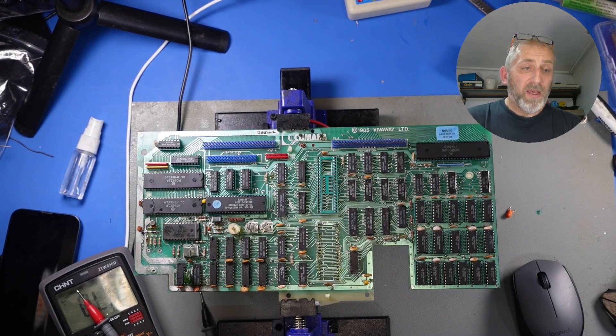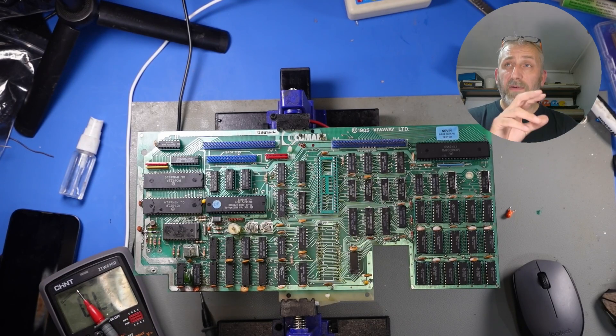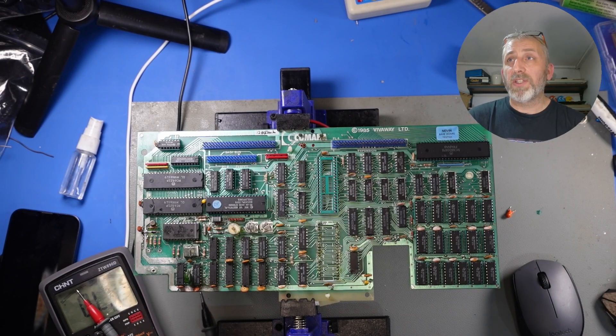At the moment, that's as far as I'm going to go tonight. Drop me a comment down below again on where to go next. What we need to do next time is replace the capacitor that was broken, and also put some power through it and get the oscilloscope out to do some probing — see if the clock's running. There are a couple of crystals down here which we can scope out to see if there are any clock signals on there.